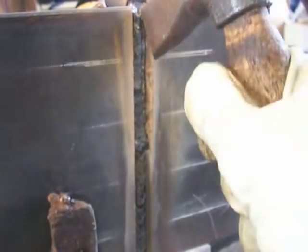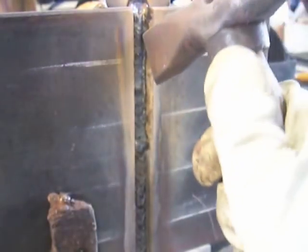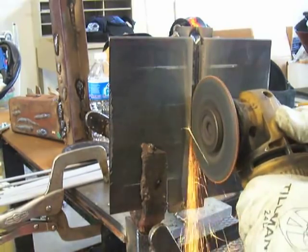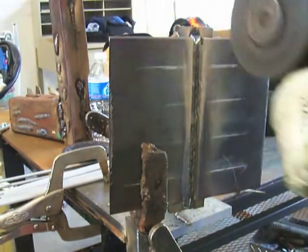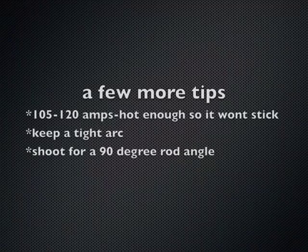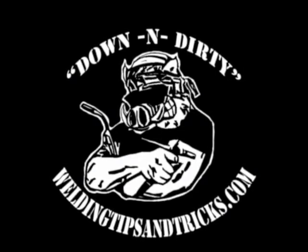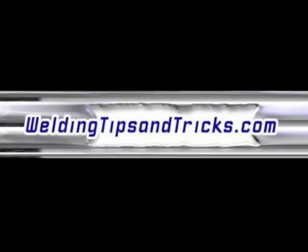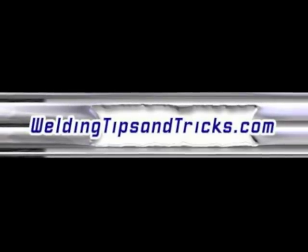You can see why I sharpen the chipping hammer — a good sharp blade really helps to rake slag off the toes of the root pass. If it's allowed, use a grinder to clean up any high places on stops and starts. That's the root pass. A few more general tips: 105 to 120 amps is a good starting point for 7018 — at least hot enough that it won't stick. Keep a tight arc and shoot for a 90-degree angle. Thanks for watching — stay tuned for part two, which covers the fill and cap.